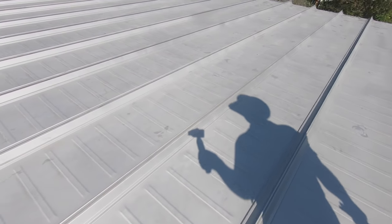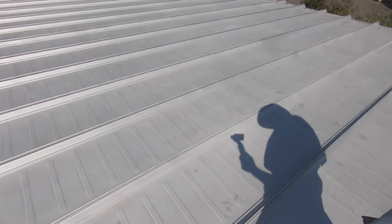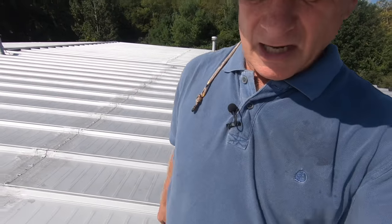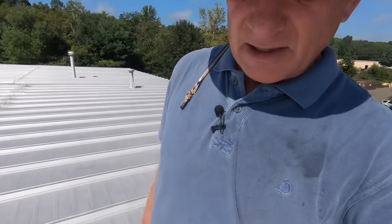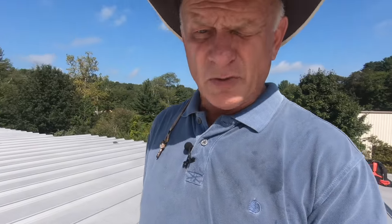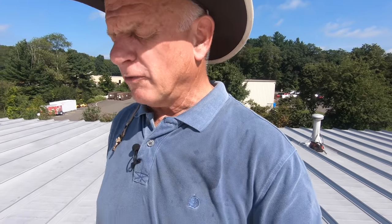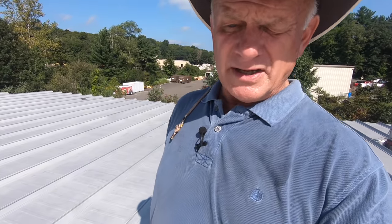But what makes it hard is to make repairs. This is the common problem. I don't call them roofers, but whoever they are, they think they can fix a roof by spraying aluminum asphalt paint over anything — like a silver coating over a rubber roof. They think that's a sealant. It's not a sealant.